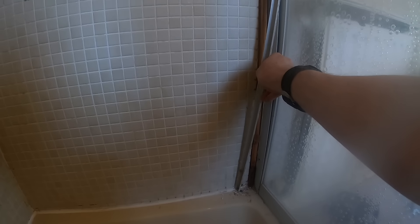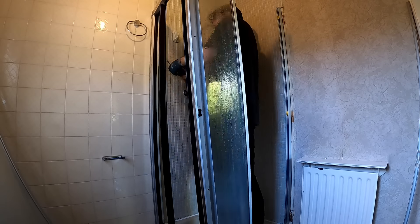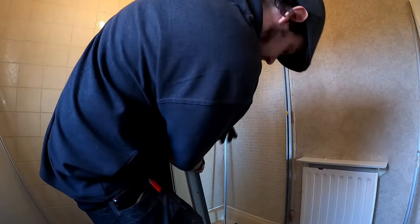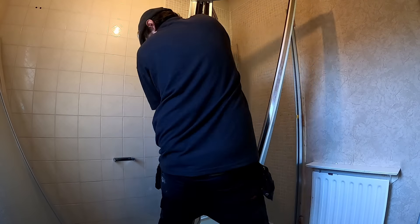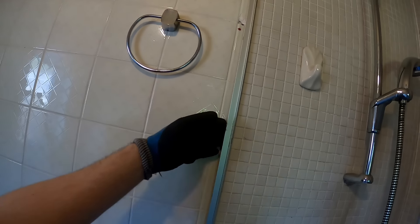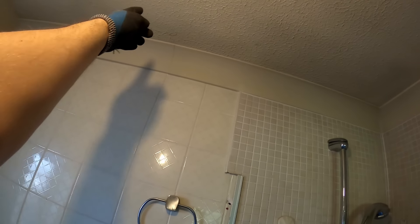I do like the wood inside the shower - to be fair it's not got wet. They've just put tile trim profiles over the top. Need to stop messing around - it's just the silicon that was holding it, get hold of it and rip it off. So I'll have to chop all these tiles off all the way through - I've got a double layer there. It'll be all right - it's having a new ceiling as well. All the coving up and off, this is being over-boarded.